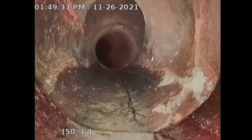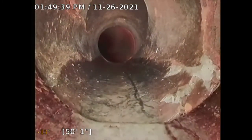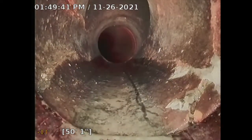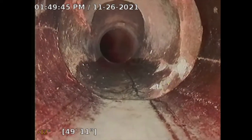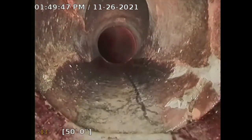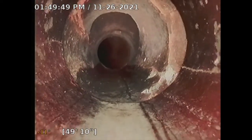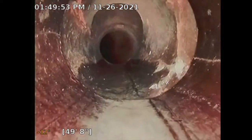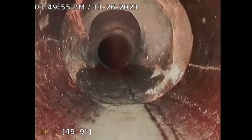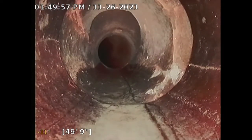All right, I located that crack. Look at that crack. It's not that big of a deal. Look, at 4 o'clock, 5 o'clock, it's there. But it doesn't appear to allow solids to pass. But you will have some leaking, probably, in that area if you were to dig it up. See on top, too, at 10 o'clock, that crack up there? So I'll note it. It's 5.5 feet deep. Looking at the front of the property, I did take a picture, and I'll note it.